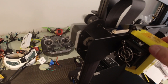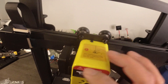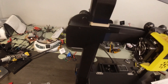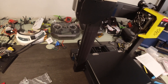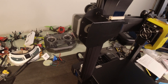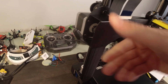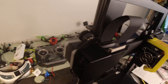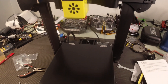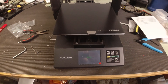I put these back on and made sure there's no wiggle — the tightening was good. In general, if I'm moving this thing I'm moving the whole gantry, so obviously there's going to be some play there, but there's no wiggle. These screws really hold this on the Y-axis and everything's nice and tight. With that, I'm going to go ahead and power it on.